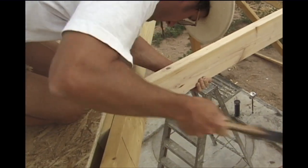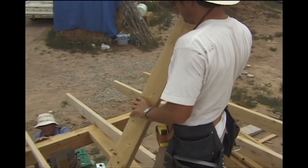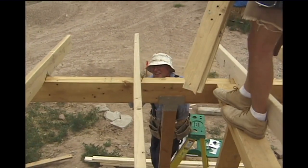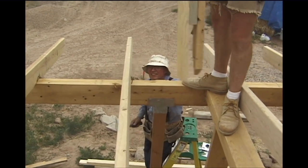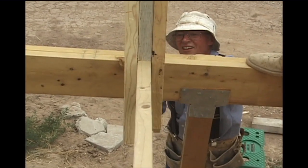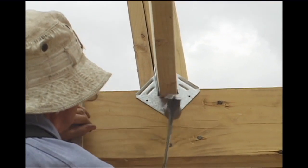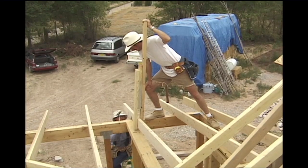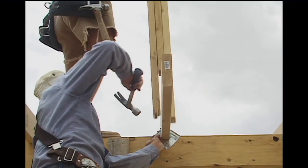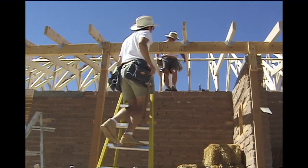This section of roof is over the bathroom, so two different directions of the roof will meet together. Since these rafters will be visible under the roof overhang, we wanted to ensure they were at 90 degree angles to the beam. So we built a giant fork that is used as a lever to twist the rafter to the proper angle. Al then installs a metal bracket that will permanently hold it into position. These metal brackets add tremendous strength to the roof and will prevent it from blowing off even in extremely strong windstorms — for a few more dollars and a few extra minutes of time, it's cheap insurance.